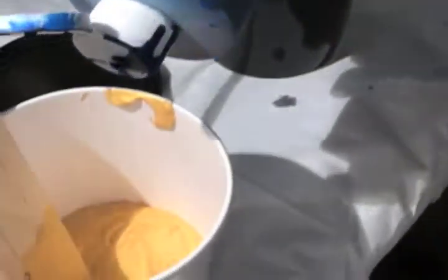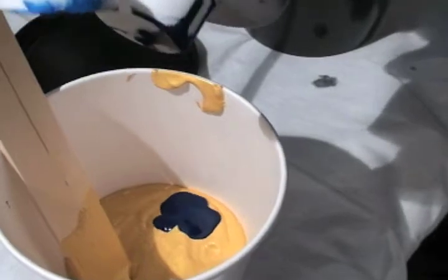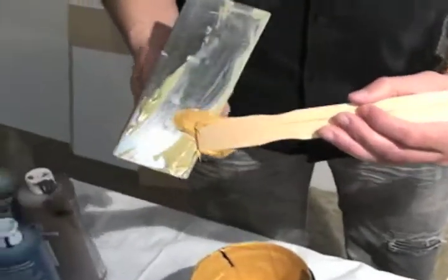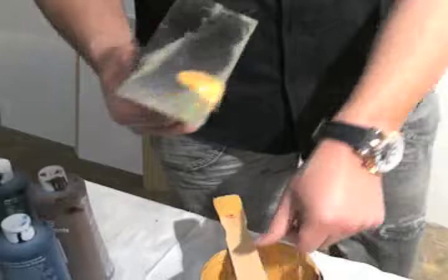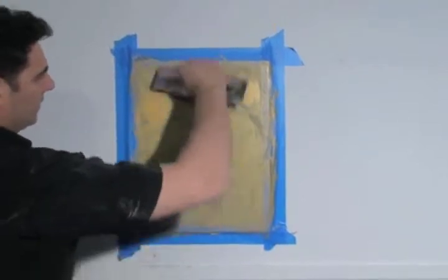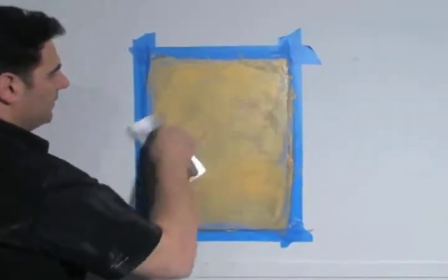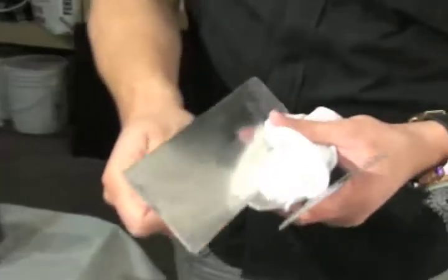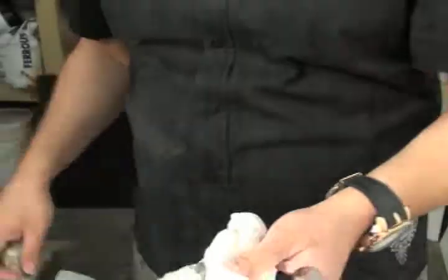This is where you use your creativity with Pearlas Velvet. Any base can be toned, like in this instance where blue colorant is added to the gold base for a marvelous green-gold effect. Apply the finish in an even application, and add more pure gold base while the first coat is still wet. Because of Pearlas Velvet's consistency, seamlessly adding different colors for a unique multicolor effect is easy and creates one-of-a-kind brilliant finishes. Spot additional colors on the surface, and smoothen with a trowel for amazing blended effects. Always clean the trowel before going back to manipulate the texture of Pearlas Velvet in order not to distort colors.